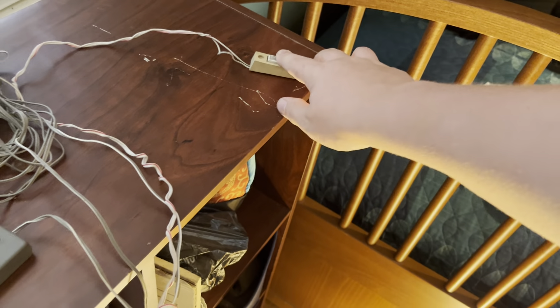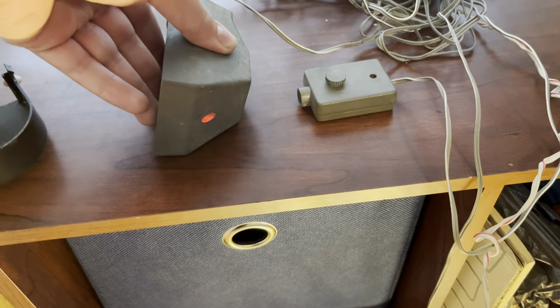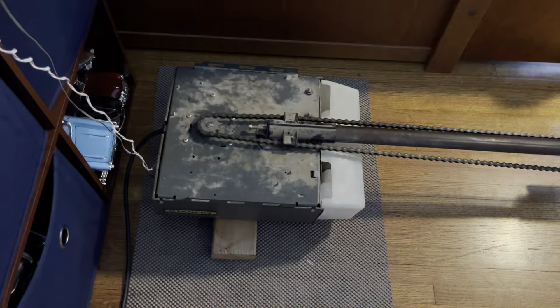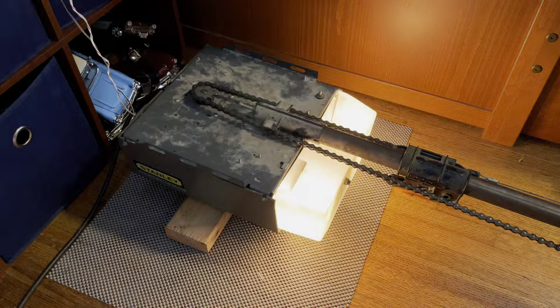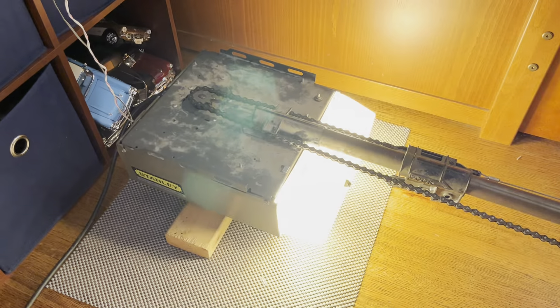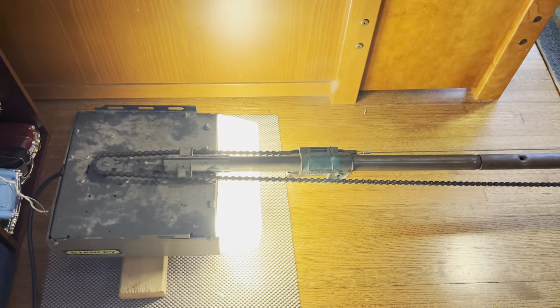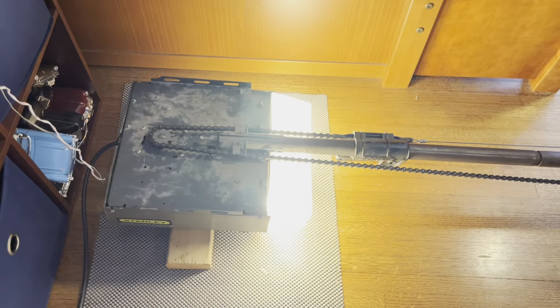We'll give it a sensor check here — I'll show you what it does when the sensors trip. If something gets in the way, it stops and the light starts blinking. The light will continue to blink until you close the door the next time. When you trip the force it does the exact same thing. If it's going up and you trip the force, it'll just start blinking. If it's going down and you trip the force, it will stop and go back up.